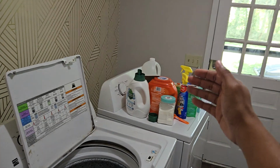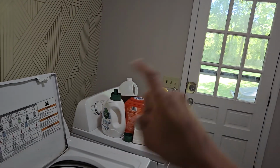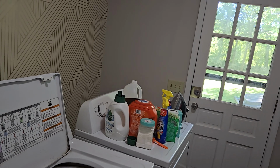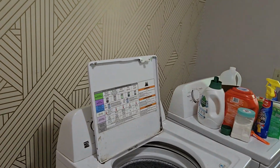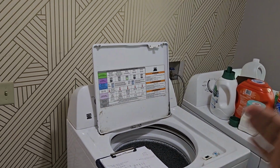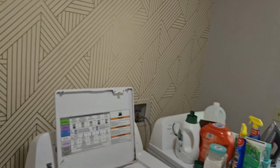So again, the idea is going to be 60 inches of space from that wall to the end of that washer and dryer. Please do remember a 2-inch filler, so we may end up with 62 inches on that top line. And let's go ahead and line up the cabinetry with that base cabinet. So 62 inches of spacing over there because of that 2-inch filler to 30-inch cabinets.